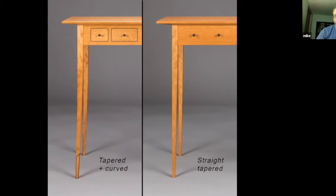So those legs were straight, I had shaped tapers on their two inside faces, I had cut mortises for the apron joinery up at the top of the legs — all of that was done prior to steam bending. Another way the steam bending process was different for me is that the legs were rotated 45 degrees. The legs were held in a cradle and rotated so that the diagonal of their cross section was vertical, and then the bend was done vertically as well. The net result is that the legs appear to bend outward in two directions.